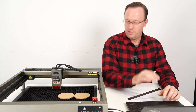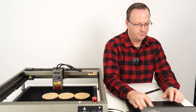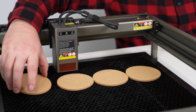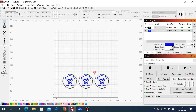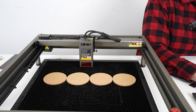Control-V to paste. We place a third coaster on the working surface, touching the second. Copy and paste again — the y-axis stays at 100, but the x-axis is 200 plus the diameter of 100, so x=300. We have room for a fourth coaster, same process: y=100, x=400. And there we have four coasters lined up side by side to be engraved all at the same time.